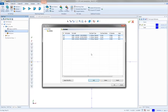It's so easy to just punch them in on the fly because you can just define it. If it's a VNMG, you just change it to a VNMG in BobCAD, and that's going to recreate the tool. The only problem you really run into is making sure that the holder is the right holder for that insert, in which case you can set up specific holders for specific inserts, and that's a really good way to get it done. So there we go.